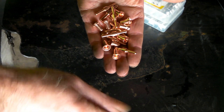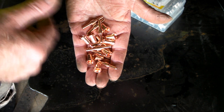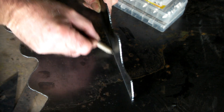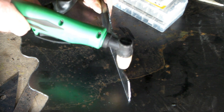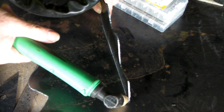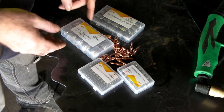Don't get me wrong — you can still do detailed work with your hand cutting and cut out shapes and all sorts of things. But you can't gouge, and you can't cut out welds. Sometimes you've got a piece of steel welded to another with a weld running down the middle and you want to remove one piece without cutting through the steel itself. With a gouging tip it's designed not to cut through — it just takes the weld out as you go along.